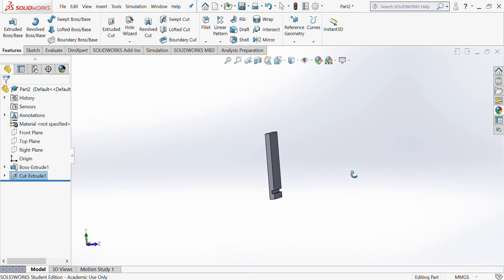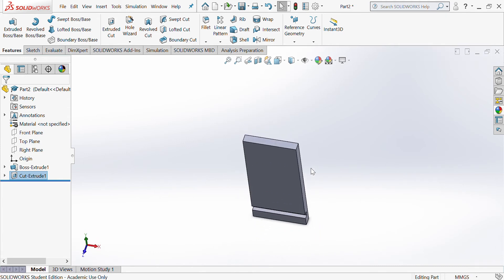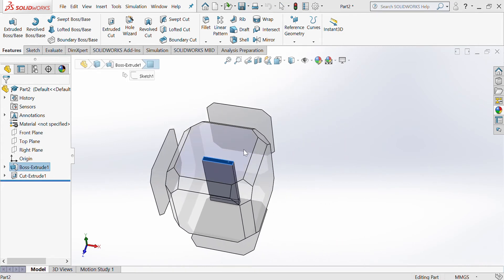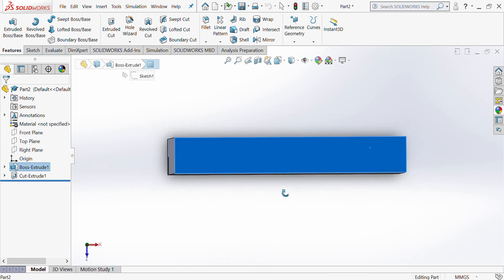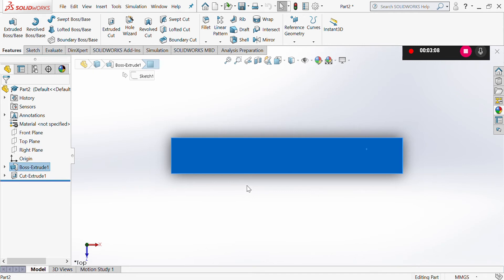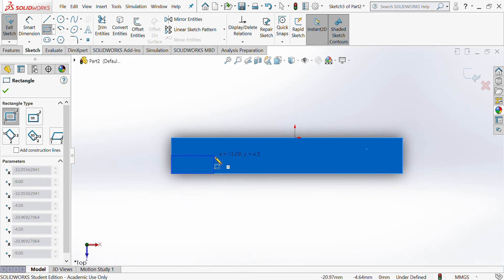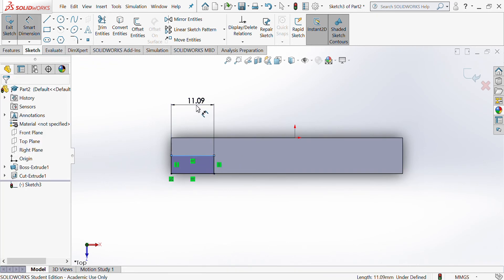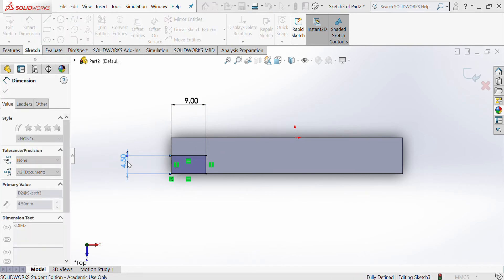What I want to do next is put in the two half lap joints either side of my part. I'm going to click on the top edge, press space bar, choose this side, and make sure I'm on the same side as the housing joint. I'll choose the rectangle tool — when you go over the corner, an orange dot comes up. Draw a rectangle 9mm across (that's the thickness) and 4.5 halfway across.